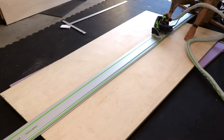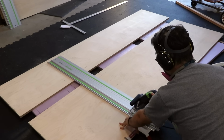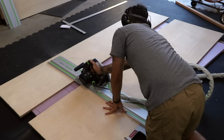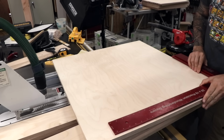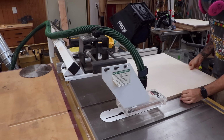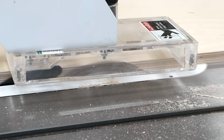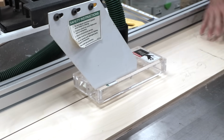Now let's get to the cabinets. I'm using 3/4 inch Baltic birch. This stuff is pretty heavy, so I find it easiest to cut the parts down on the ground with a few styrofoam insulation boards for support. For the cabinet sides, try to find at least 1 square corner. The square sides are then put against the fence to cut the panel to its final dimension. The support cleats are also cut at this time.